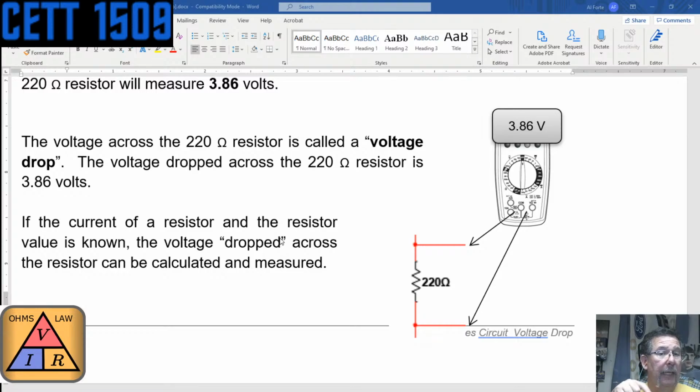And then remember what I just said. You can look at the resistor, and the resistor says it's 220 ohms, but we're measuring it as being 223 ohms. That's going to change the calculation too. And depending on how many numbers you use past that decimal point, how accurate you are with those numbers, is how you'll get a more exact answer. So just keep that in mind.